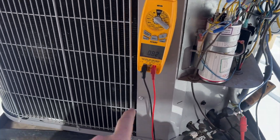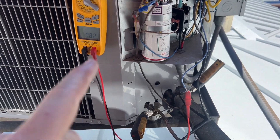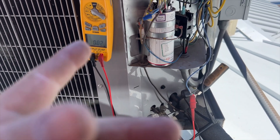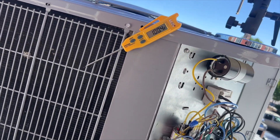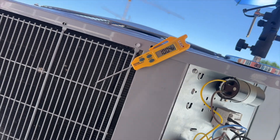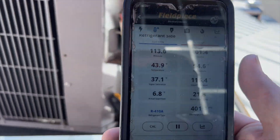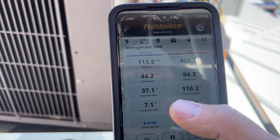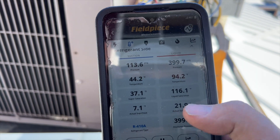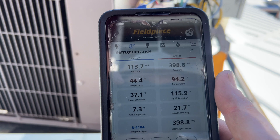She's been running and started beeping, so the pressure switch reset. We killed power, reconnected, and turned it on. It's 100 degrees out here at only 10 a.m. These are our pressures — superheat's looking good, though this is a little bit high; target is 14.